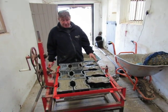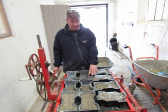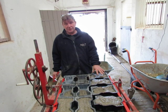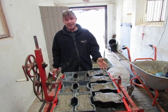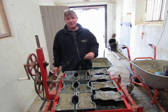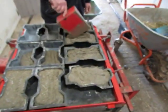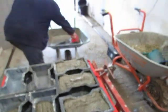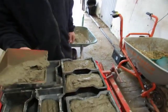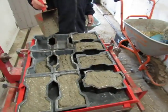Here we are showing you how to make 10 pavers at a time on the table, fitting in 10 paver moulds. The mix is a block mix which is a 4-5-2: 4 sand, 5 small stones, crushed dust and 2 cement. As you can see, the consistency of the mix is what we call a wet cast mix, so it's flowing and this gives the block a nice decent finish.